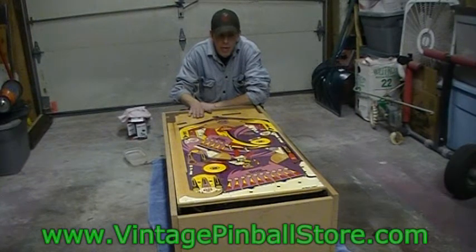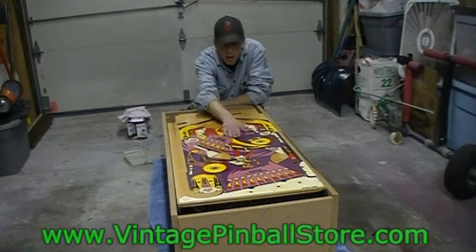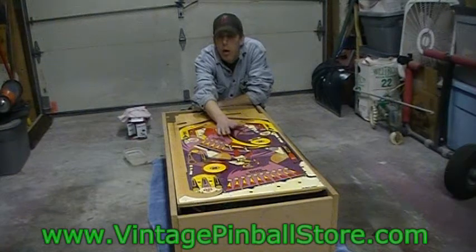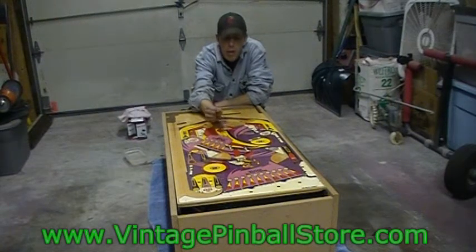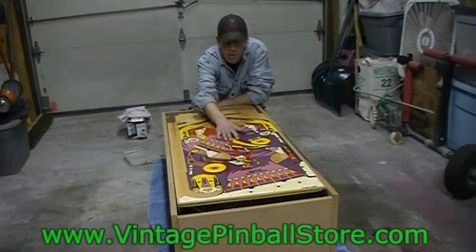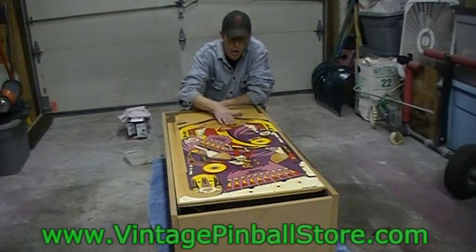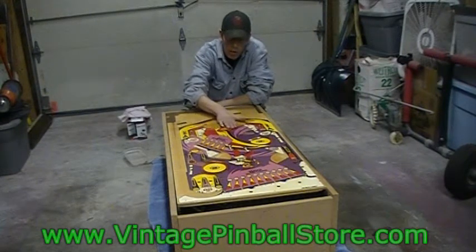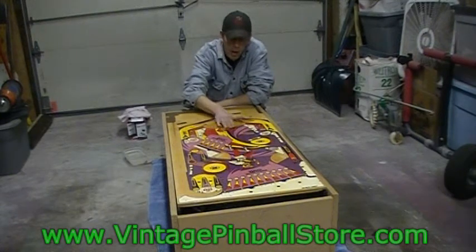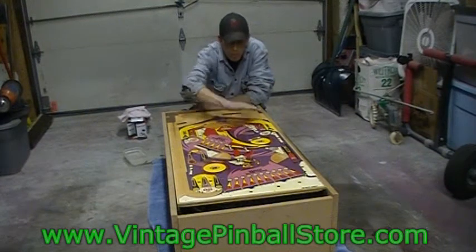The playfield is already pretty good, but if you run your hand over it you can feel some spots where a solvent pop has happened - a little air bubble comes out and it makes a little nib in the playfield that you can feel with your finger. Also there was heavy planking - vertical lines in the wood in this area - and I can still feel them.